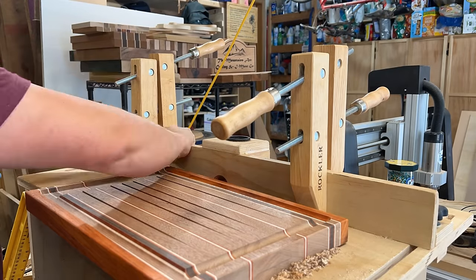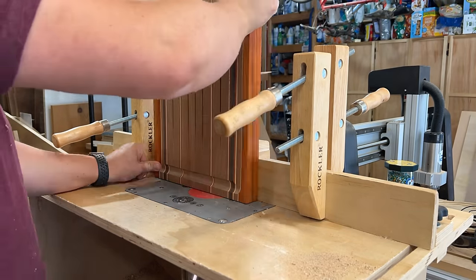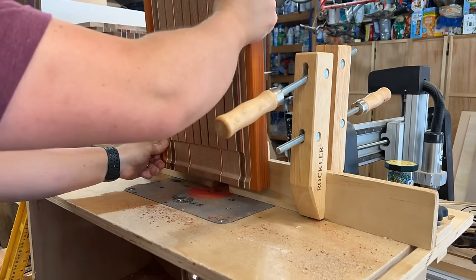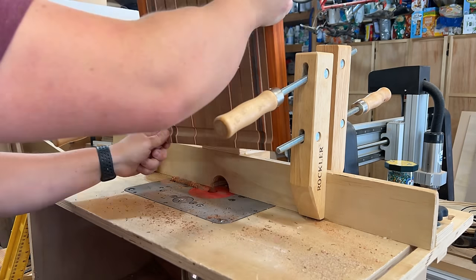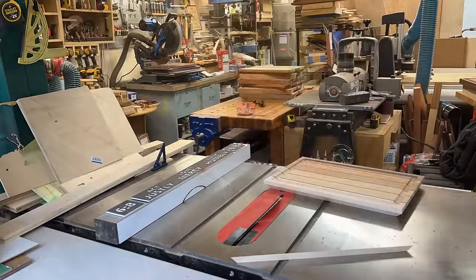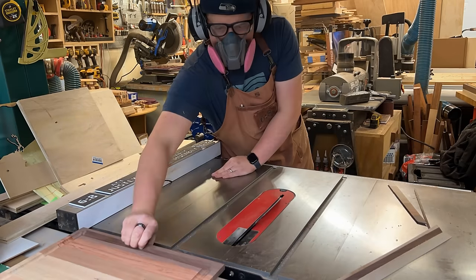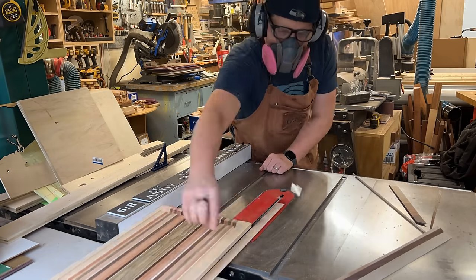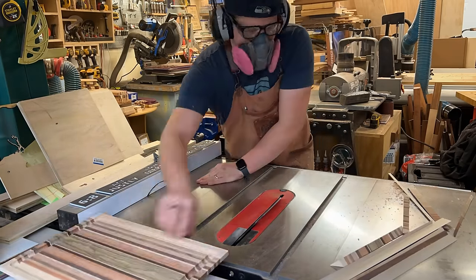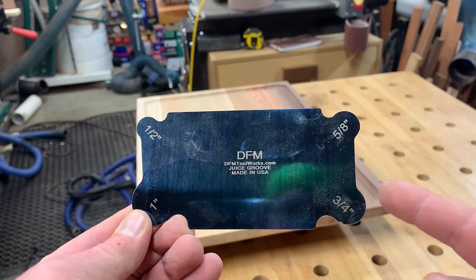I have a separate video that covers different handles and hand holds in detail. Another option shown here uses screw clamps on the fence to add a groove on the inside — not visible on either side, so you can flip the board and you can't tell. The round nose bit gives a slick result but can produce burn marks more easily. The easiest hand groove is just a big chamfer cut at the table saw — a 45-degree bevel on either side — so your fingers can go underneath and the board sits nicely.